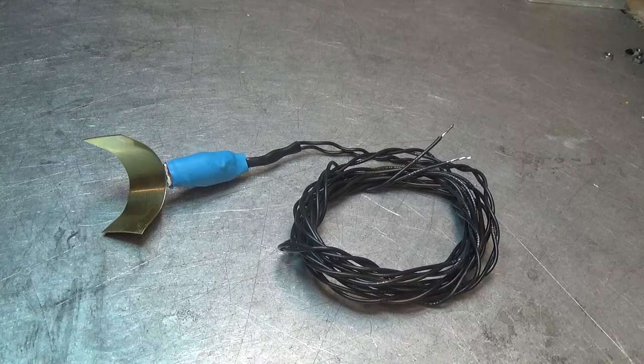This is the standard brass sensor that is shipped with the controller if you do not order any of the other sensors. Now keep in mind, if you order the brass plug sensor or the inline sensor, this sensor is not shipped with the controller. This standard brass sensor goes on the outflow port of your radiator — not the inflow, but the outflow.